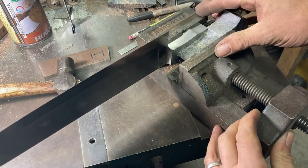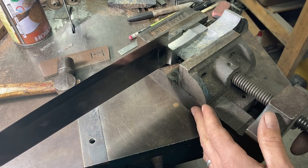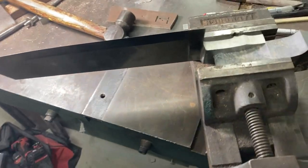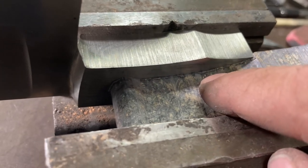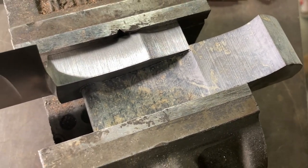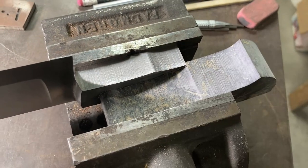I use a palm-grip four-inch heavy drill press vise with parallel jaws to start pressing this wood into the bolster. It's slow and controllable and I don't want to exert too much force at a time. Ideally what you should be seeing is a little curl of wood being shaved up by the edge of the tang, which is broaching itself onto the wood all the way around. We're in there about 3/32nds of an inch or so, then we're going to tap it back out, remove a little material ahead of where that curl was, and shove it in again.